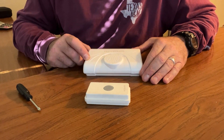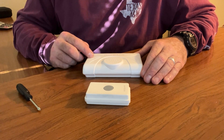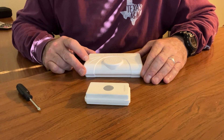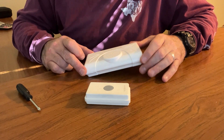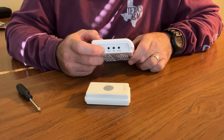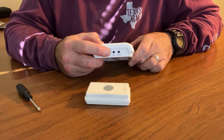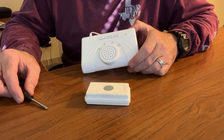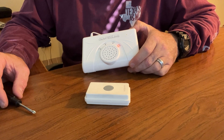There are two basic steps to programming: first, program the transmitter or sensor to the unit; second, set a melody to a specific zone. By default, the unit plays a basic ding-dong sound, so if you're okay with that, you can skip the melody programming part. To begin, turn the unit to the side — there are three buttons: mode, zone, and volume. Hold down the mode button for about three seconds until you hear a short tone. The zone one LED will then start blinking, indicating you're in programming mode for zone one.